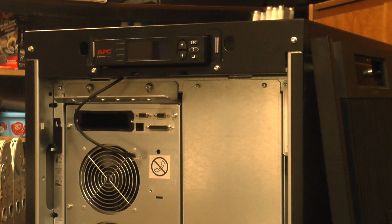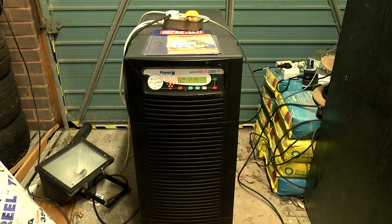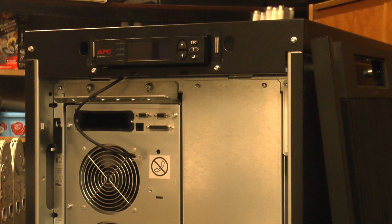Another question was whether or not it could be run from a separate power supply, such as this PowerWave 3000T — could this basically act as a battery charger, using the battery terminals at the rear of both units to link them together? I doubt it, because although the VT would probably be happy to keep discharging its batteries as the 3000T fills them up, the 3000T will be seeing no power demand on its own inverter output, so presumably not offering much more than a standard charging current to feed the batteries. If something's trying to haul several kilowatts and that something isn't its own inverter, it's not going to be best placed. In any case, it doesn't seem to want a cold start from battery, so that ain't going to work anyway. So no second life as a three phase motor drive for this one.